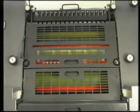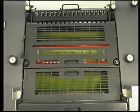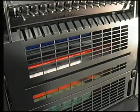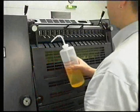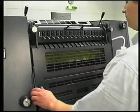The press should be set to between 5,000 and 6,000 prints an hour for washing the rollers. Carefully spray a little wash-up solution onto the rollers. Use the lever to position the blade onto the ink distributors.